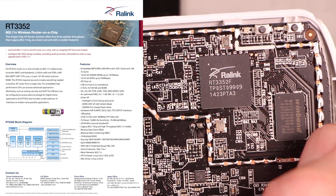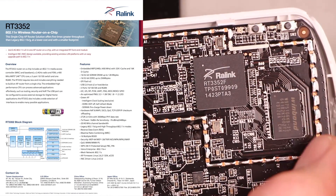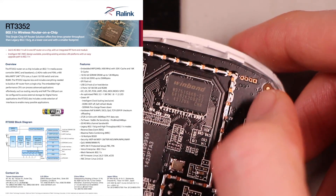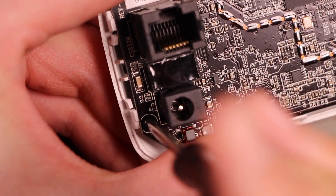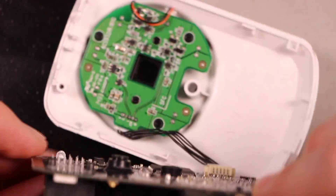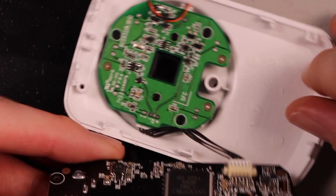With a device this integrated, that's probably an entire SoC, and that would explain it being connected to what appears to be some external DRAM. There's a wire - that's for the IR illuminator, it looks like.